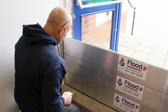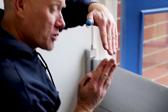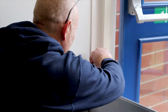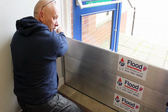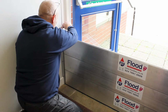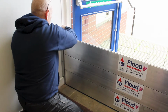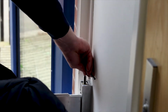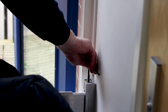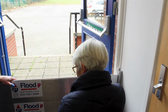So it's at this stage now that the boards are firm. If we try and tighten down before we tighten these screws up, then what happens is the boards can actually do this. Right, so that keeps them vertical. Makes sense. So now what we do is we do 2 turns. 1, because obviously we can't turn around because of the wall. Let's do yours. Big one, yeah. 2. Now that pushes the sill down onto the floor against the ground.